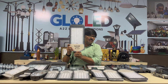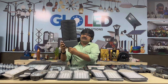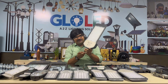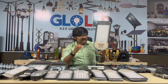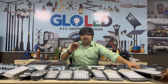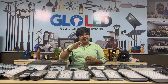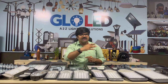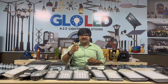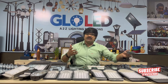This is the 100-watt streetlight lens model. For a 10-meter pole, you need 100 watts. For a 7-meter pole, you need 70 watts. For a 6-meter pole, you need 60 watts. For a 5-meter pole, you need 50 watts.